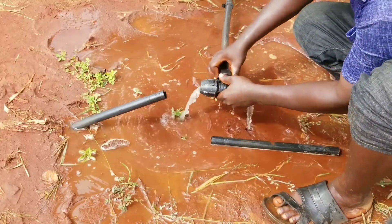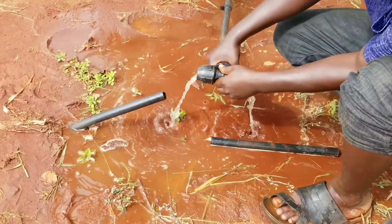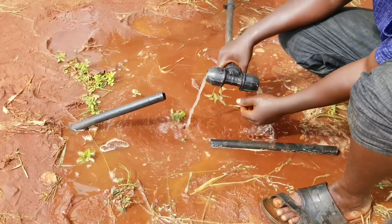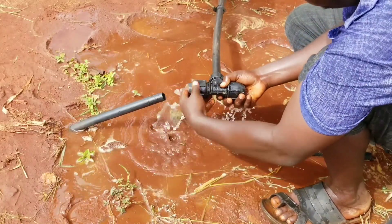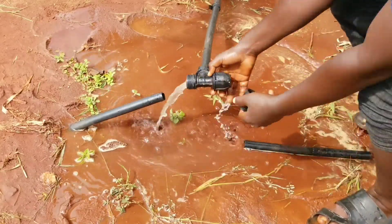When you are trying to buy a kind of coupler, make sure that it's of the same size as that of your main PVC pipe lines so that they will fit together. So just unscrew those nuts, then insert the nuts first on your PVC pipe.